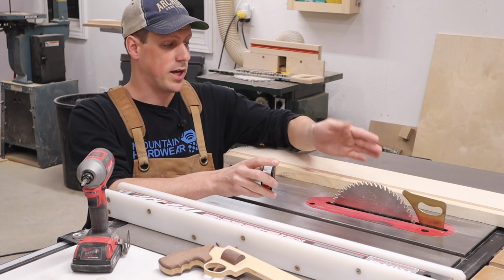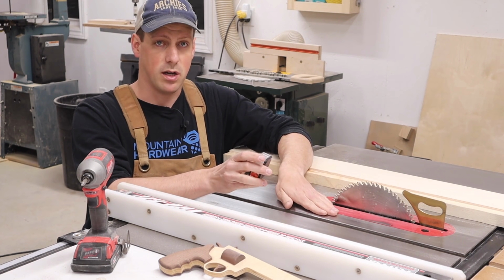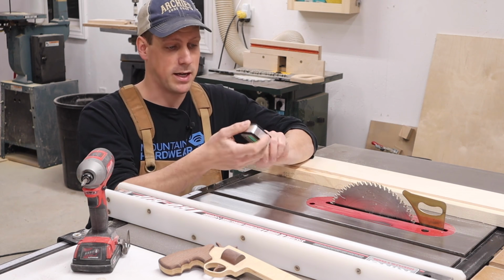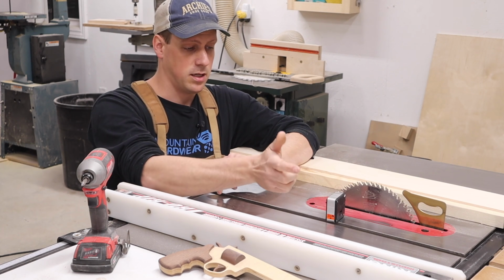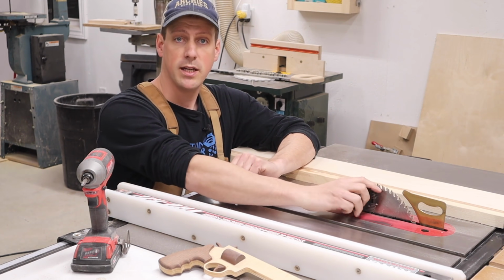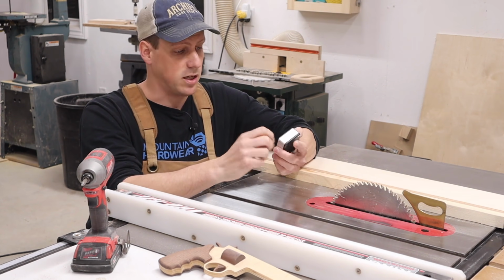Next, you want to make sure that your blade is perfectly 90 degrees to your table saw. Now, what I'm using is one of these little digital level boxes. They're magnetic. They stick to the top of your table saw and they also stick to your saw blade, which is really handy. I'll put a link in the description if you want to get one of these for yourselves.